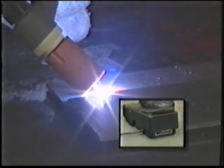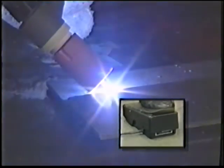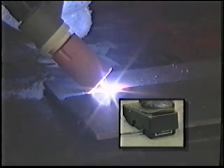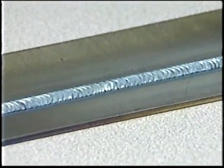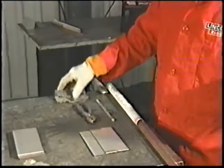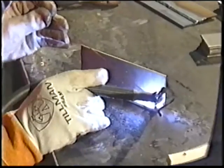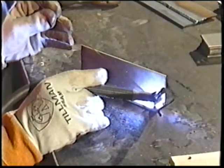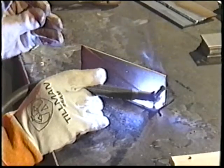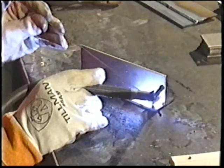Now, a lap weld with mild steel. Here, the top edge of the upper piece will be melted or fused to the lower plate. Again, circular motion as before — a clean, smooth weld. For practice with adding filler metal, let's start with mild steel. Clean the rod with clean steel wool. Note the consistent pace of the repetitive motion; the operator keeps the end of the rod within the gas-protected area. The next training weld is a horizontal fillet weld using filler metal — tight circular motions, dabbing the filler metal in as needed. The use of filler metal is ideal with bad fit-ups.